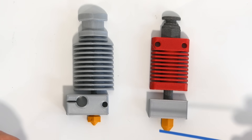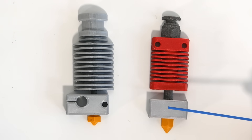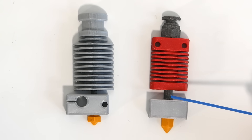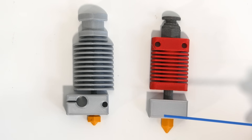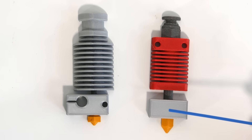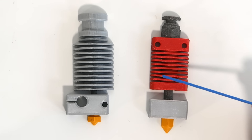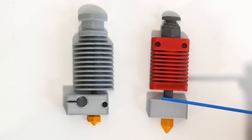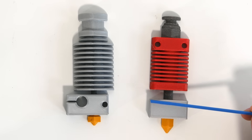This is where the heat break and heat sink come in. The heat break's job is, as named, to break the heat from moving up into the filament path and avoid having the filament melt inside the heat sink. Heat breaks tend to have a very thin casing around the exposed areas in order to be as efficient as possible. While the heat block generates heat and also heats up the heat break, the heat sink is actually kept cool by a fan, which in turn cools down the top part of the heat break and keeps the heat contained within the heat block.